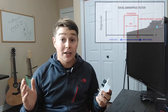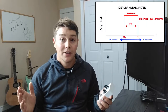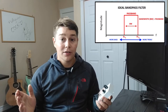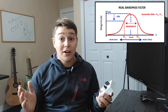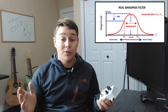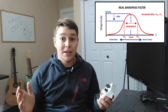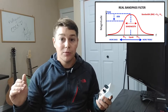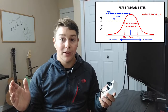The second major characteristic of a bandpass filter is its bandwidth. In an ideal situation, the bandwidth equals the width of the passband — so a 1000 Hz to 2000 Hz passband would have a bandwidth of 1000 Hz. But in reality you won't get a sharp cutoff, you'll get more of an attenuation on either side. So we measure the bandwidth at the -3 dB cutoff frequency: once the amplitude has dropped -3 dB on either side of the passband, that gives us the real bandwidth.